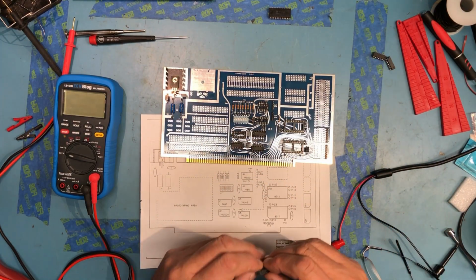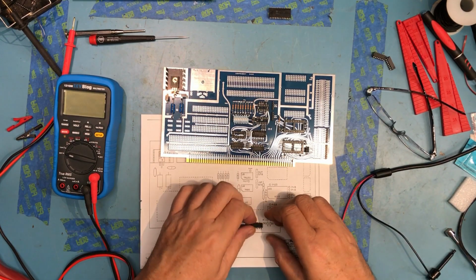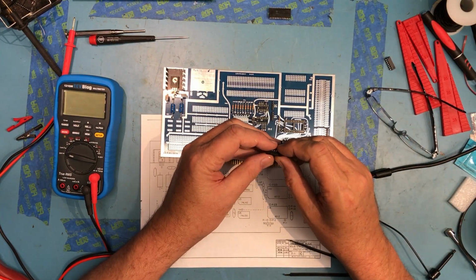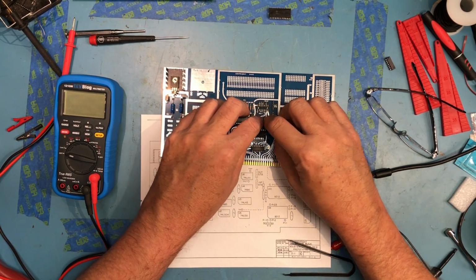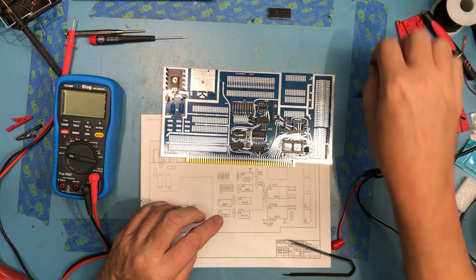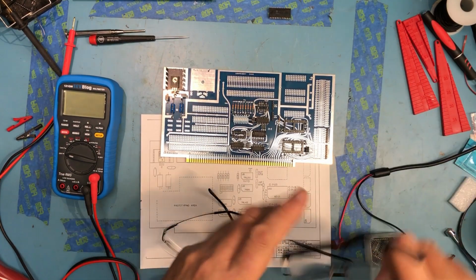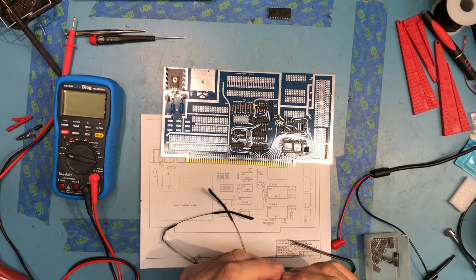I've got another 7400, which is up here high. Actually, those leads are really nasty, so I need to... That really is an 86. I need to find a 7485 and a clean 7400. So I'm going to stroll on over to my parts bin. Sorry for doing this off camera. 7486. This really lousy 7400. 7485 parts drawer. One of these is actually a 7485. Yeah, that one is.